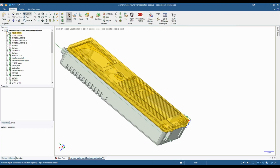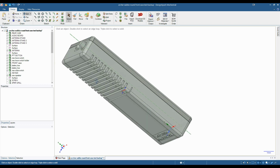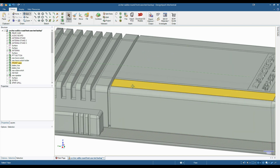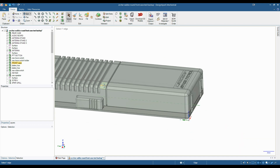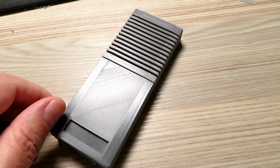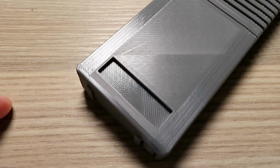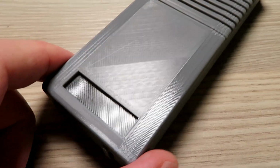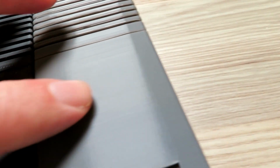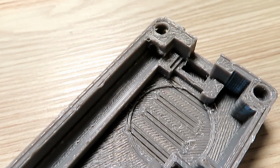Anyway, the battery can be simply cut out and rewired and moved, and on paper and on the CAD, let's just say, I managed to get the radius that I needed on the front of that, although on the 3D printer it came out a little bit stepped. I can fix that by printing the case vertically. You can notice the definite slight stepping, but I still think the overall effect is pretty decent. I have printed one of these since vertically, and you don't get that problem. So anyway, I was really pleased with how most of this came out.